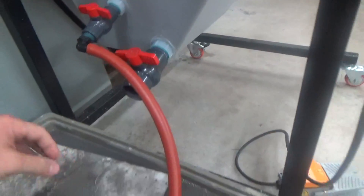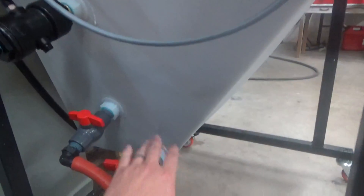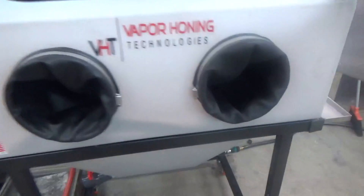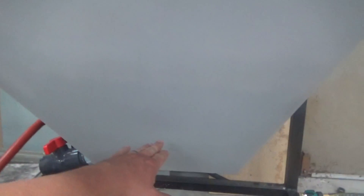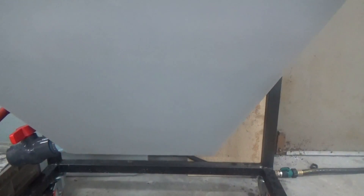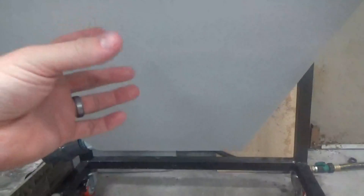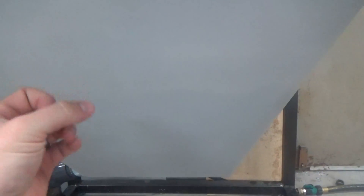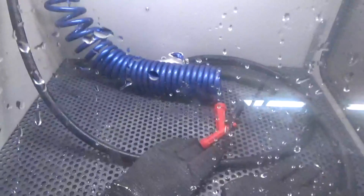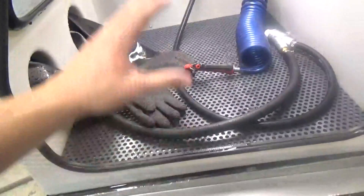This should take you about 15 to 20 minutes tops — and that's how you clean out the machine. After you drain the entire machine out, put a couple inches of water in the hopper and basically purge the system. Start the pump system up to clean any remaining abrasive from the pump, snail housing, or the lines. That way you have a fresh machine with no abrasive, and then you can put fresh water back in the hopper.